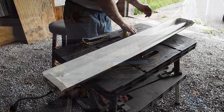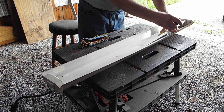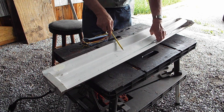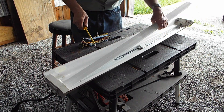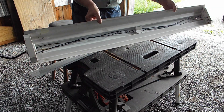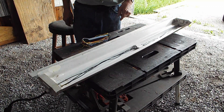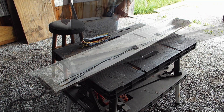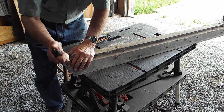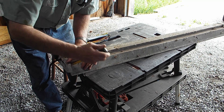The first thing I want to do is get this center piece out because I want to see what kind of ballast I've got in there. Obviously it's not compatible — there were only two on the FEIT list that were incompatible. And there is no ballast. I've never seen a fluorescent light that didn't have a ballast. My next step is to pry this end cap off and see what's under here.